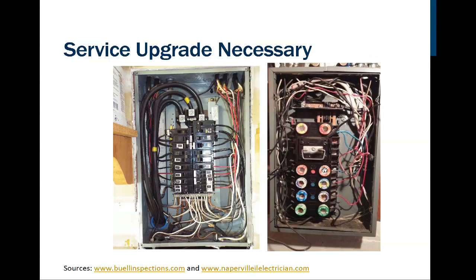And this is what a fused panel would look like. This is the main fuses. Those are normally cartridge fuses, and this handle is used to pull them out. This is an old circuit, right? And so it's got quite a few branch circuits on it, and the different colored fuses are different sizes. So there's a green, and then there's red, and there's blue. More than likely 15, 20, and 30 amps. Notice we're also color coded here, red, blue, and this is also blue, and notice the one on the bottom isn't even colored. And up here we've got some higher ones. Can't read them very well.